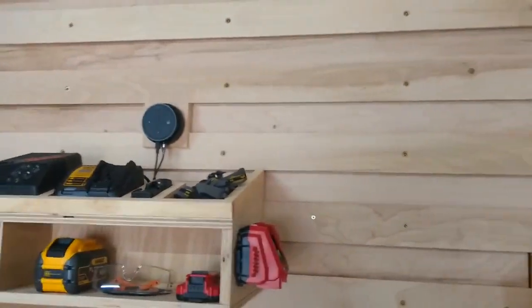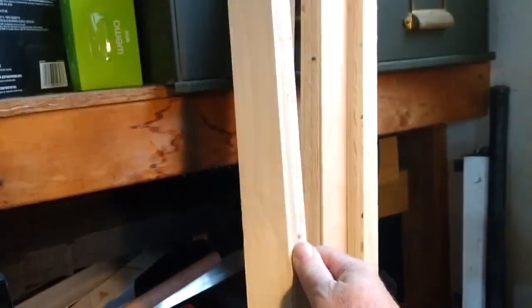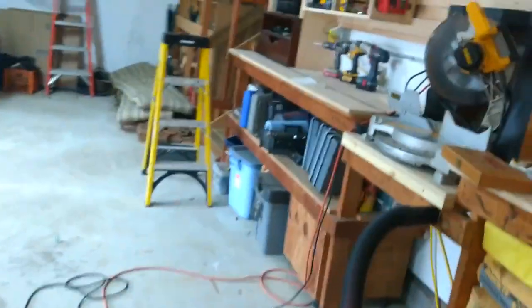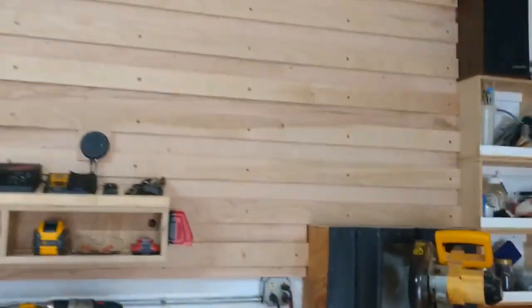The simple little locking key works really well, so for light items you might knock off when lifting stuff, the locking key is going to be really handy. I ripped some plywood when I had this all set up, so I've got a bunch of cleats ready to go and a locking key strip — I just cut them and use them as I need them. That's one of the key reasons these things all had to be the exact same distance apart, so those keys will easily fit any fixtures I want to put up here.